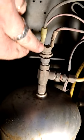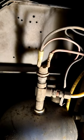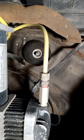Here's a pressure switch right here — this one is a 95 PSI pressure switch. That's all this needs. And the compressor's right there. I don't even remember what brand it is — it might be a generic one. I've replaced it a couple of times. There's a little check valve right here so air doesn't leak back past the rings, and here's the little air filter for it.